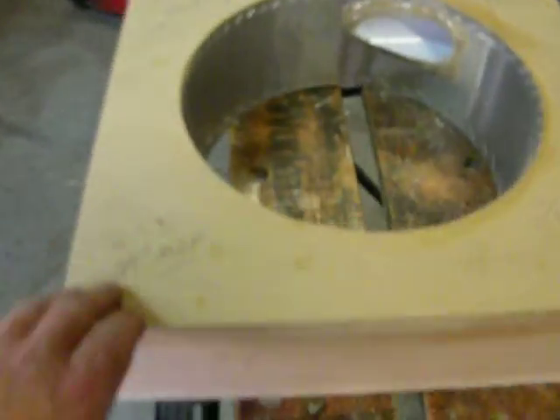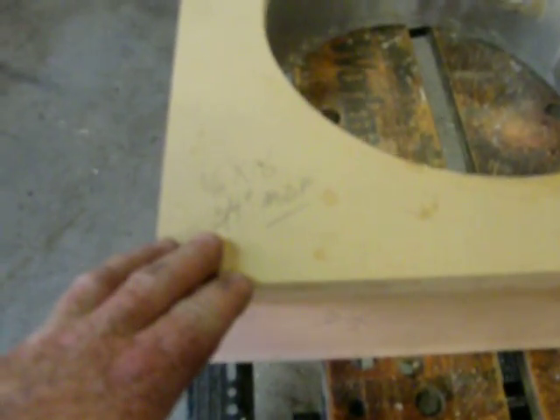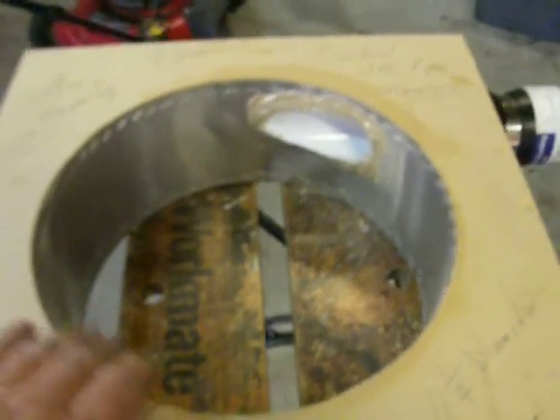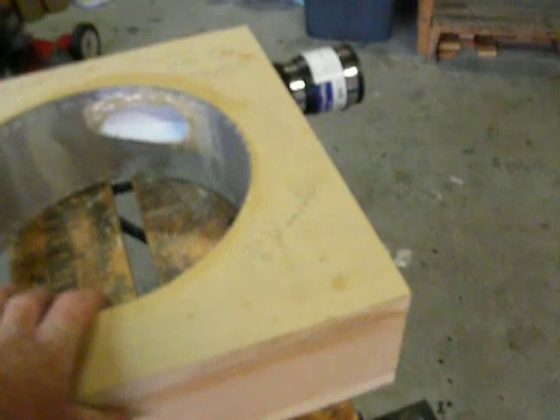It's really simple to make. It's made out of 16x16 MDF — I used three-quarter inch. Then we have some Valley Flashing, which I've cut five inches wide. I've put it all together with staples and PL Premium. And then we have some central vac pipe and some central vac pipe couplers.